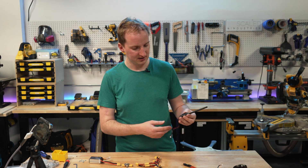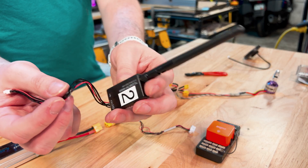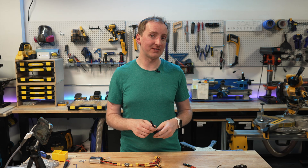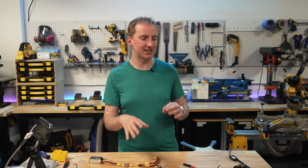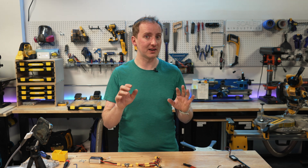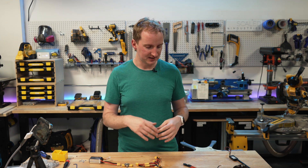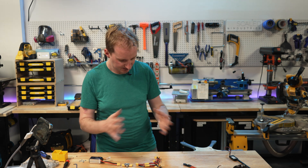Finally, you need some kind of remote control and guidance. Here I've got a telemetry radio — normally you'd use that for remote command and control in terms of autonomy. You would also have an actual remote controller with its own receiver that plugs into the flight controller as well. I'll have both an RC receiver and telemetry on this drone, so I can set waypoints and monitor status from my laptop and change settings. Making the thing fly is a careful series of hops — changing some tuning, hopping again, tuning in the air. It's good to have telemetry for that and the actual RC controls to do things like force a landing by pressing down on the sticks.